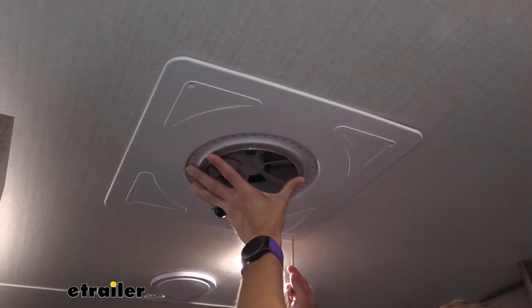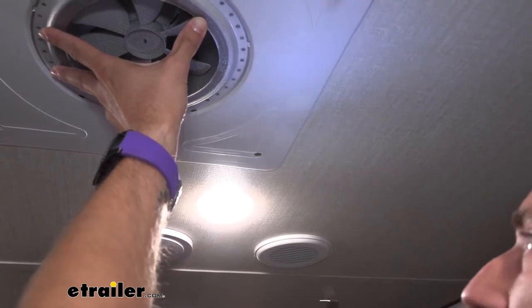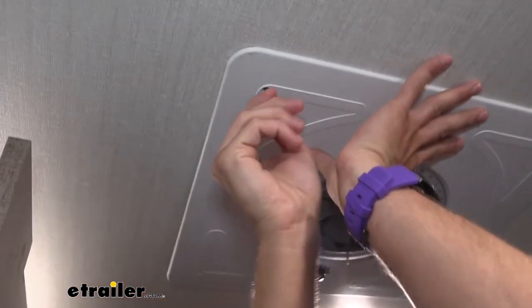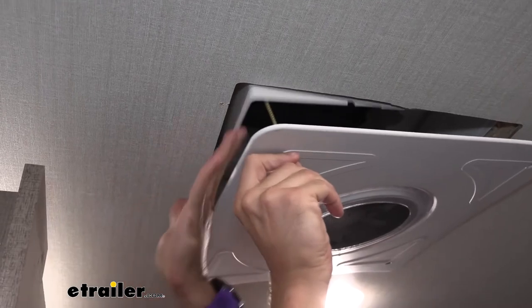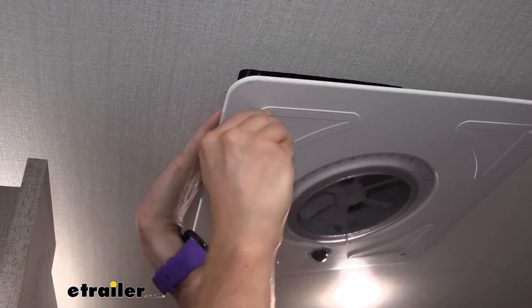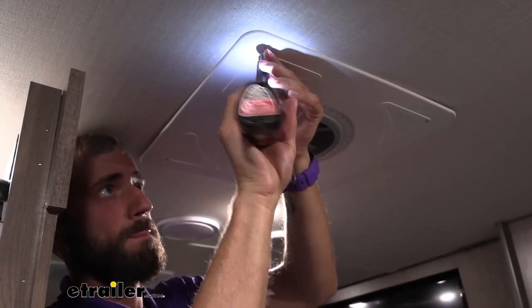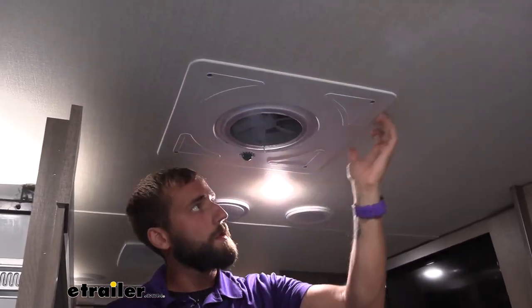As I'm putting this up in place I'm going to move my wires so that they're going through that little notch I made, keep them out of the way, and start sliding our vent up in place. I'll take one of my screws and get this started — I'm not going to make that fully tight yet, that's just there to hold it in place. I'll come over to the other side and make sure we're hitting on each of our corners. I need to push that back up into place — we've got it nice and solid.